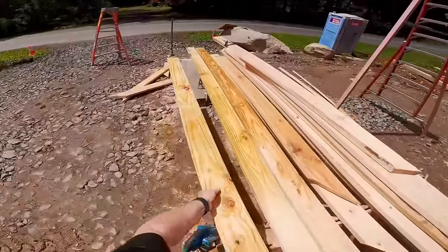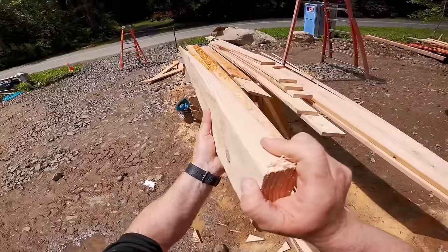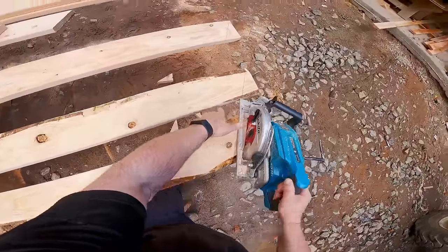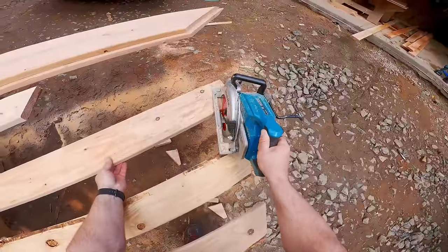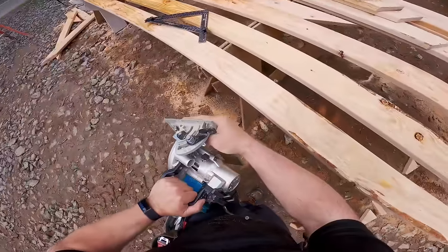sharp, so I'm going to hook that and then measure to the long or the sharp of the plumb cut. So everything is sharp to sharp to sharp to sharp, but I'm only making one compound miter cut and essentially getting two rafters out of it. And I'm also cutting the crowns out of the boards to some degree. I've already culled them so that they're not super ugly, but this just kind of contributes to a flat roof.